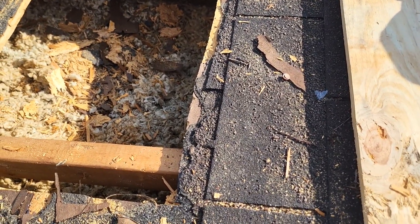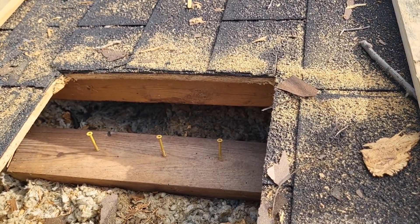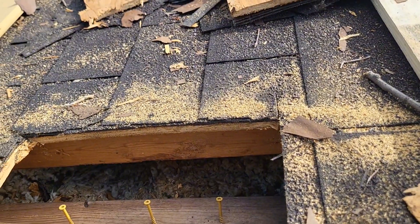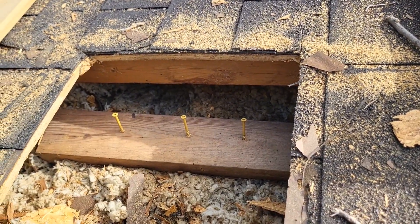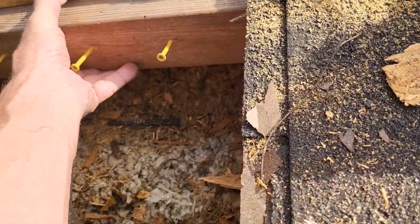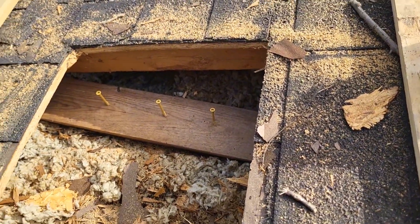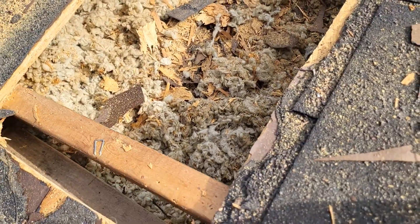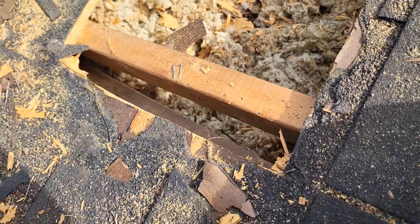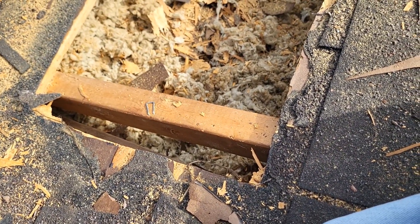You can see where I extended the hole just a little bit from the previous cut to get to the other truss. Start a couple screws and a two-by-four. You can see where I put it up under there — that'll give me a place for my plywood to rest on that side. I'll do the same thing on this side, but being as the hole was so big I'll put the two-by-four on this side and screw in from the outside. There's no way it's gonna go anywhere.